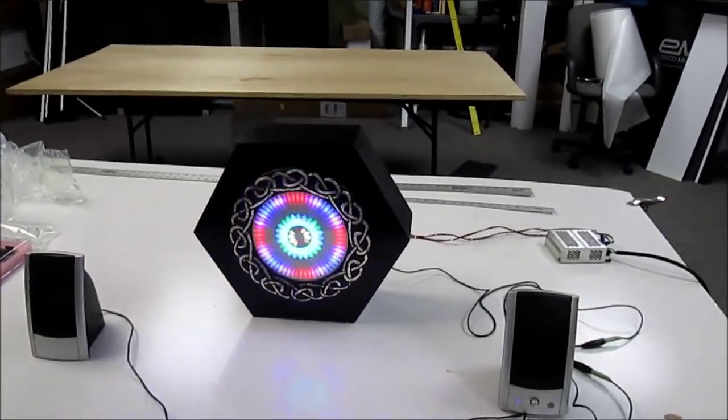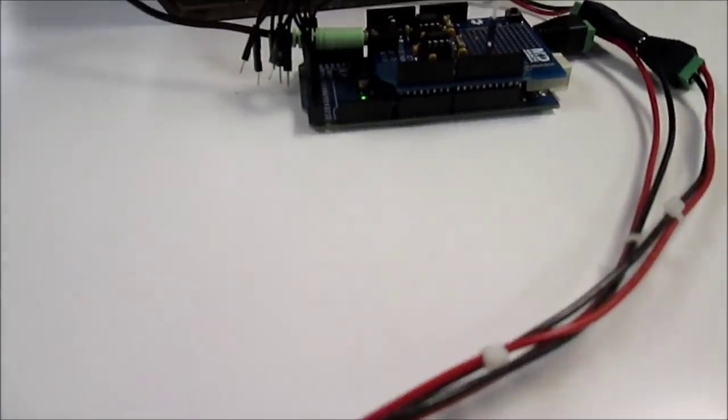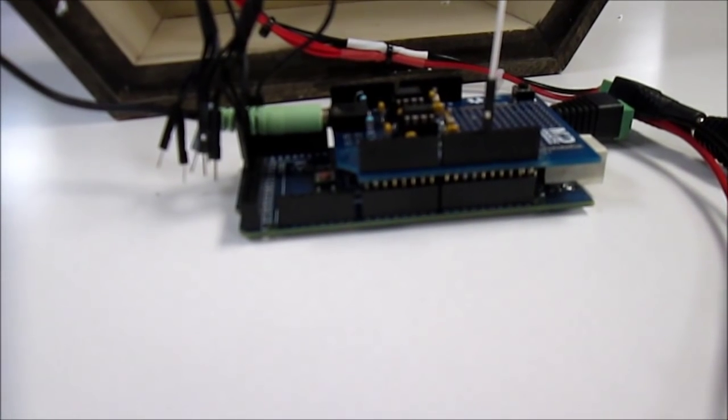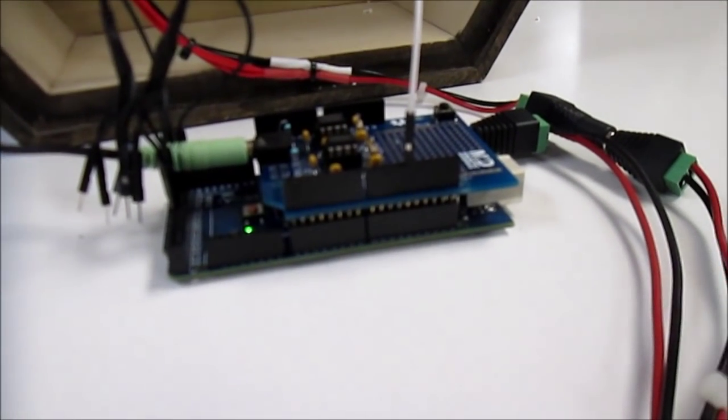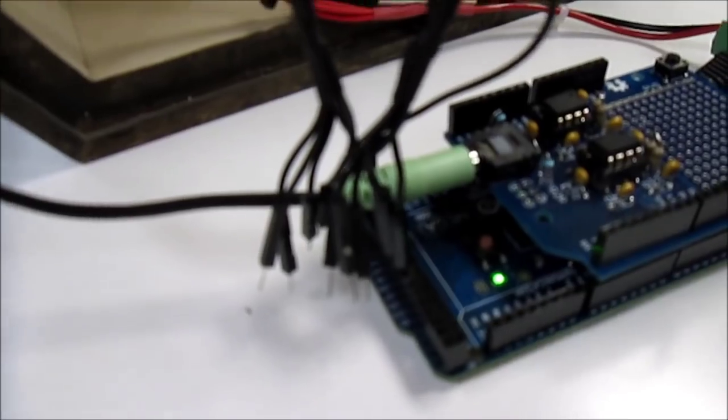The only problem when you're trying to test it is when we move around to the back. At the bottom we've got the Arduino Mega, on top of that we've got the little sound card that's taking the audio stream and breaking it out into its different spectral frequencies. But the control is all performed using these wires — the back end is connected to ground and I have to physically take these and plug them into the various controls for modulation, anti-aliasing, rotation clockwise, anticlockwise. It's a real pain because every time I want to see an effect I have to run around the back of the clock, plug a wire in, run around the front, see what it looks like, run around the back, change the next wire.